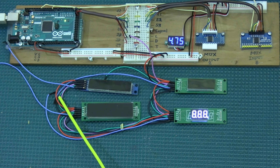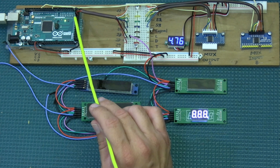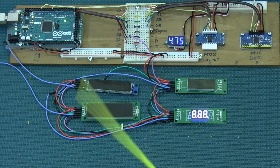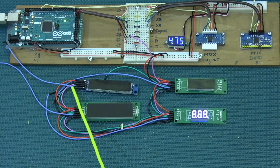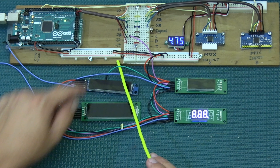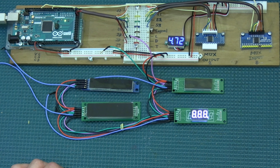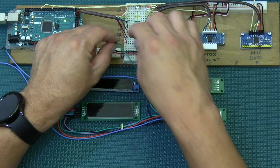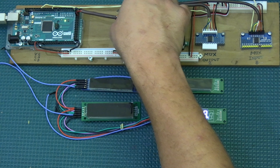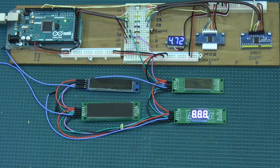Next is the green wire — that's the L line, going to pin number 27 on the Arduino, or in my case through my distribution hub which connects to pin 27. I follow the green wire from display to display to display and then to the L line. Instead of running four separate wires like in my previous videos, I'm just doing it all together with one daisy chained wire — much cleaner.